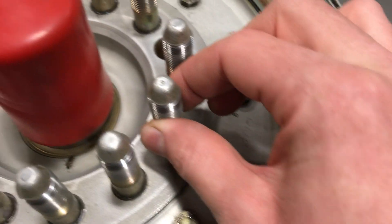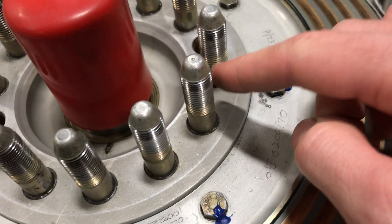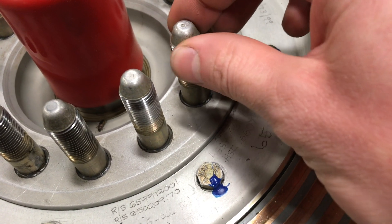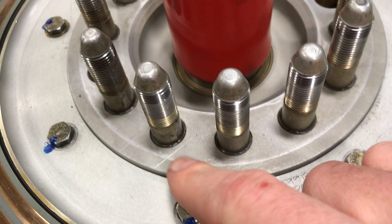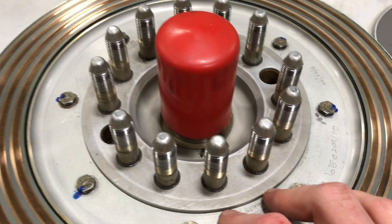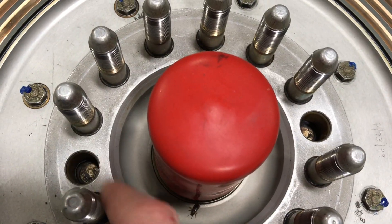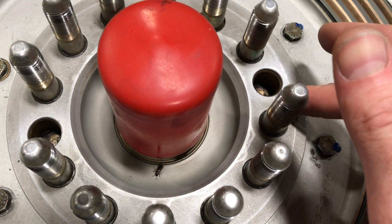There are 12 of these and they kind of free-float. Maybe some other time I could show you inside the hub. Picture the other side being a bolt head — it's pressed in but they each move a little bit, floating in a recess that's embossed into the hub on the inside. The dowels are the spots on the prop flange and on the hubs themselves too. On that older style hub especially, you really need to pay attention to cracking.